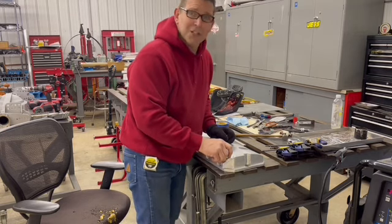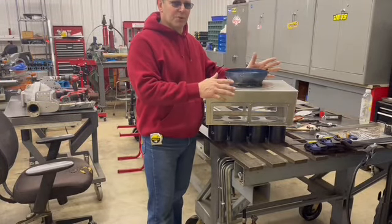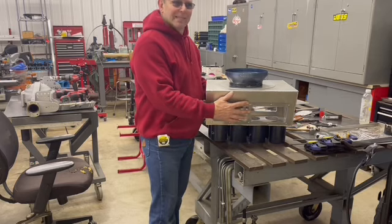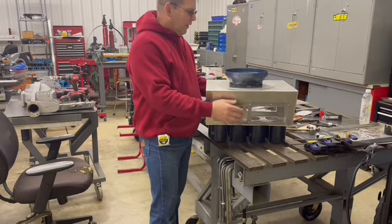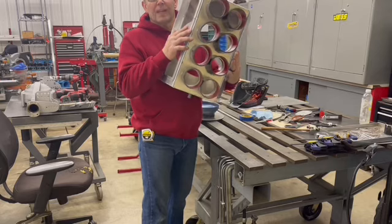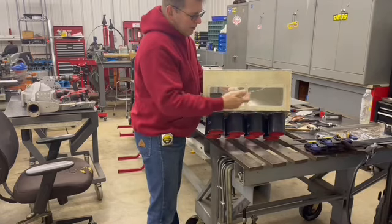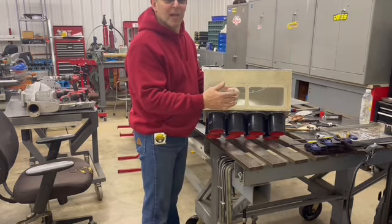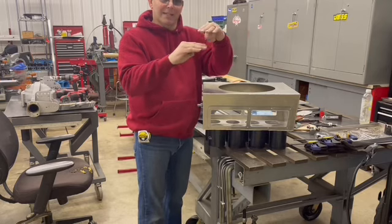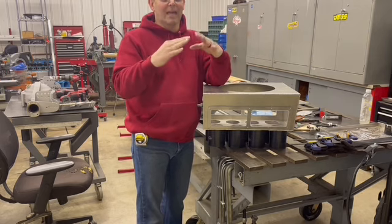On to our next miscalculation. The next item on the list of things that we have to refine from our original design to dyno the engine is this more or less intake plenum, which slides over all of our velocity stacks on top of each of our 8 throttle bodies. We're able to look inside and see if we get any fuel splash coming up out of each throttle body. We created a certain height of our intake manifolds based on where the hood sat, and we angled them based on the hood.